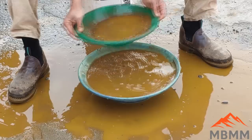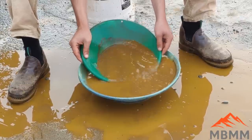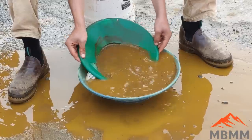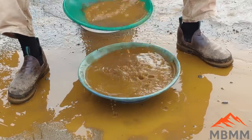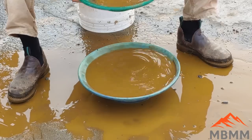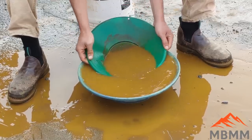But this could be paired very nicely with like a 6-inch by 10-inch or an 8-inch by 12-inch gas powered jaw crusher. So you could take both machines up. They will easily fit in any standard pickup truck. Take them up into the hills. You can take run-of-mine ore, larger pieces, quartz float, crush them down to half inch or 3/4 inch minus in the jaw crusher, and then feed them directly into the hammer mill, down onto the sluice, and you can be processing several tons of material every day right out of the back of a pickup truck